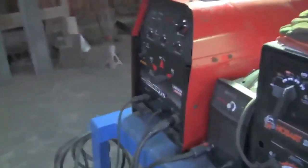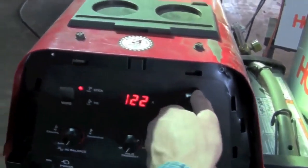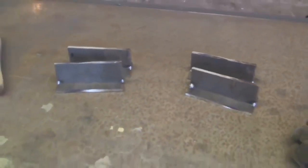A week or two back, I made a how-to video demonstrating a couple of simple and easy-to-learn ways to get good-looking strong welds with 6010 and 6011. I said in the video I didn't know which method would be stronger, and a bunch of people said I should test that. So that's what we're going to do tonight. I've got four joints set up, two on each side, and in the interest of doing things in a scientific fashion, we're going to average out how many hits they took before they broke. We'll do the whip and pause first at 90 amps running eighth-inch Lincoln 6011s.